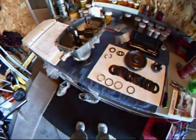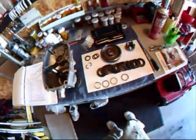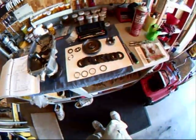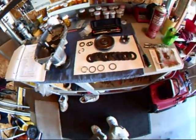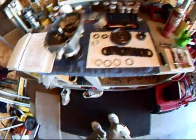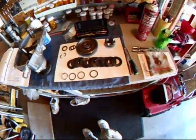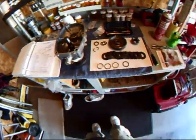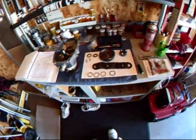We have our half rings, angular rings, thrust washers, our dog gear, and at 200 hours, Rotax recommends replacing the Belleville springs on here. So these are all brand new. We have our distance ring and our 3 shims. Like I said, I've already dry fit this together to get exactly what I needed for shims, and we're going to start reassembly of this.